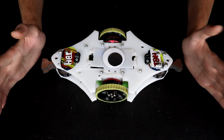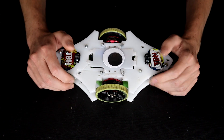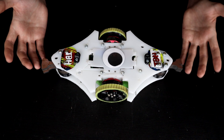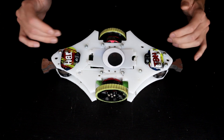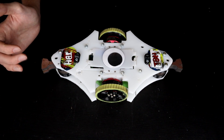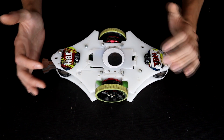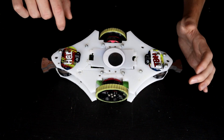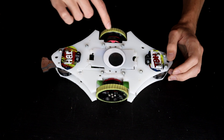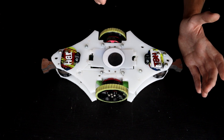The fight event has happened already and I know how it all went — subscribe if you want to see how this MeltyBrain does, you will not regret it. As you can see, the weapon teeth are now on and the Melty is balanced — it is not touching the ground on either skid underneath. I've balanced it by removing a bolt on one side because the battery slides a bit to the back, so taking out one bolt meant everything mostly balanced. Wheel position does seem to affect that slightly.